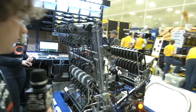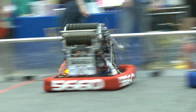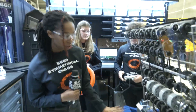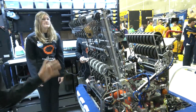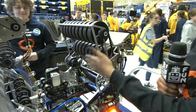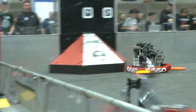Now let's move on. I've talked to Jasmine — we're going to talk about this awesome under the bumper intake. We decided on using an under the bumper intake because it seems the fastest to intake a piece and get it back to where you need it to be. It's controlled by a single motor, so it's simple to intake and goes straight into our index. After it goes past the index, it goes straight into our shooter. It waits by the feeders while the shooter warms up — usually give it two seconds, and then you press your feeder button and it will shoot right out.